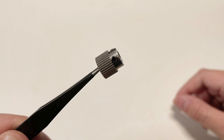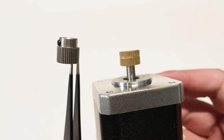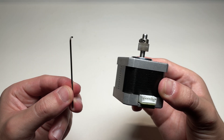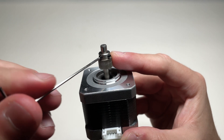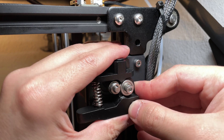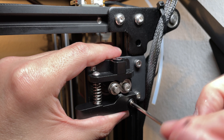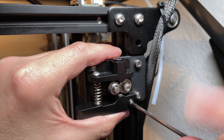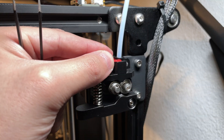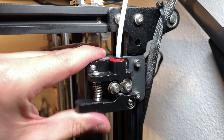I went ahead and purchased stainless steel gears, which provide better grip and stronger teeth compared to the stock brass gear. Changing the gear is as simple as using an allen key to unscrew the tiny screws that are attaching it to the stepper motor. Make sure that when you're screwing the gear in, it's properly centered in the middle so that the disc is aligned where the filament is being pushed through. Once you've attached that gear, reattach everything back to your printer, calibrate your e-steps, and send off a test print.